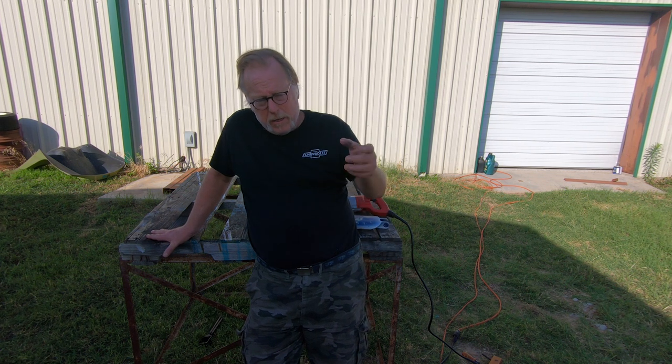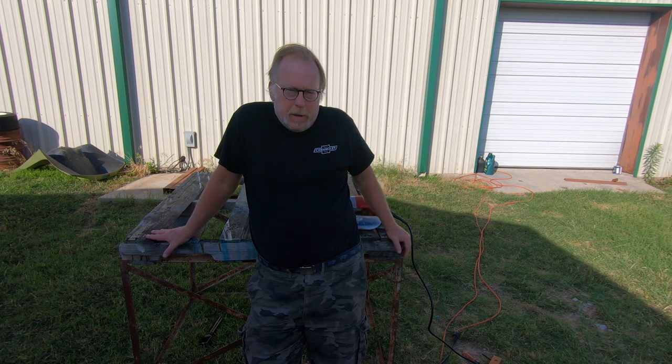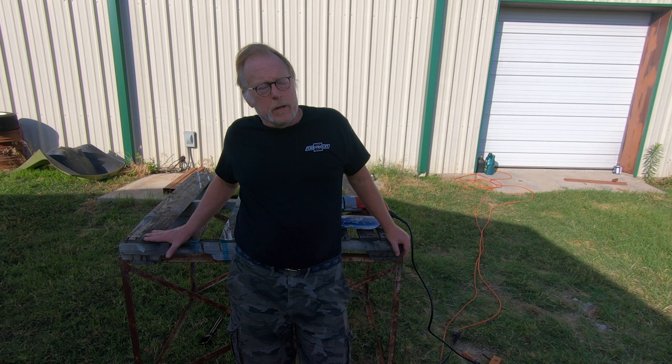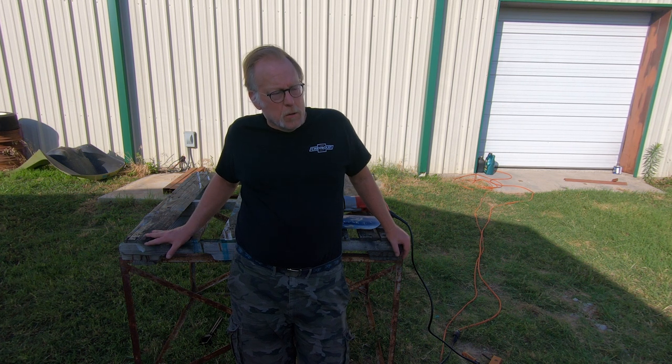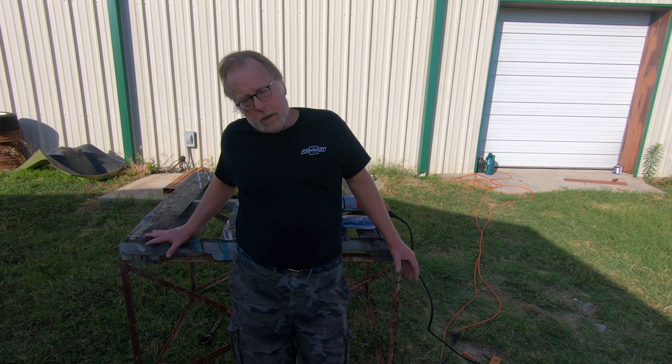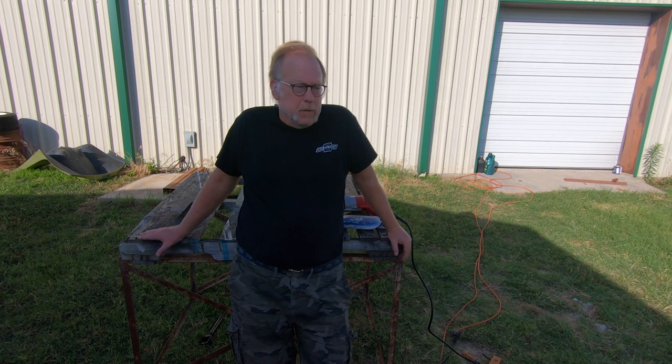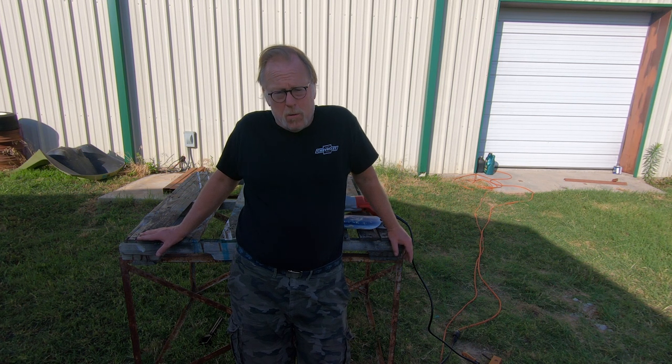Landing gear will come out, those will be cleaned and blasted. We'll do magnetic particle inspection on them. We'll put on the replacement wheels and brakes, get rid of the old Goodyear wheels and brakes. The nose gear and all that will come off. Because we'll have firewall forward off, we'll be able to take the nose gear and all of that assembly off, completely strip it down, get it all clean. And it will also allow us to inspect the whole enchilada too.